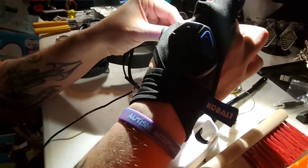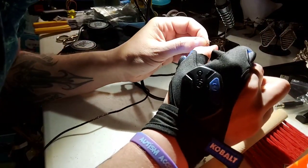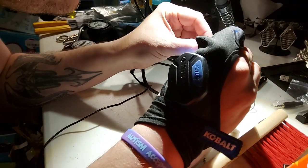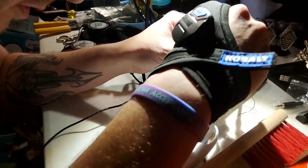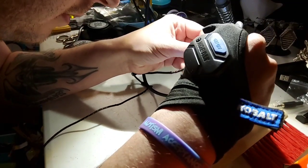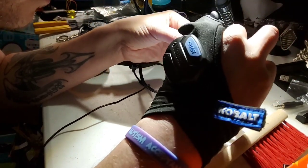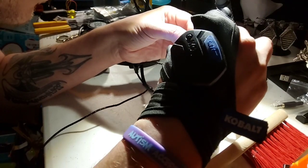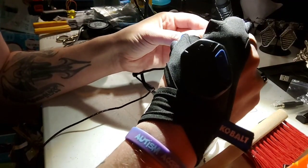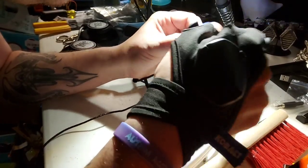Okay. So again, same procedure. Coming from the inside to the out. Coming right through that hole that I just reopened. This time we're going to try to get two wires through there, which is not always the easiest. But if we can pull that off, we can make the ground nice and solid. We can get this in one masterful stroke, and it'll be a lot better. But two wires, two sets of copper, is always a little bit more difficult than one.